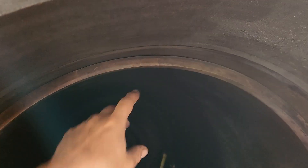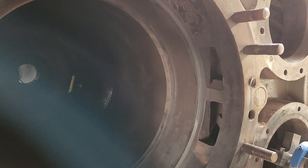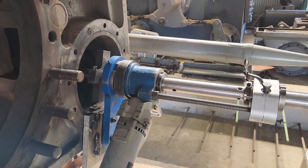I don't know how much better we can get it — maybe putting two rings in there will help — but I think the steam is just going to blow by right there during that part of the stroke. It's not worth reboring the entire cylinder to take care of that little bit. A little further in it kind of goes away and we've got a fairly decent seal around the rest of the way. So I think we'll be fine with maybe making two rings instead of one. I don't have a lot of experience in this — never done this before — so it's a learning process.